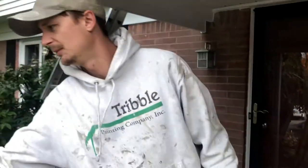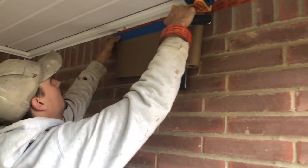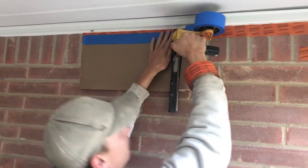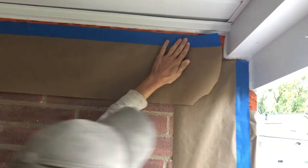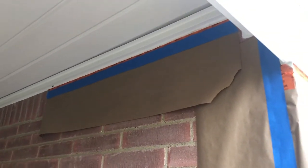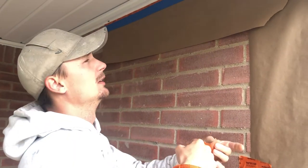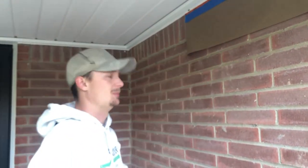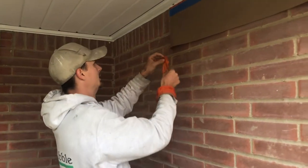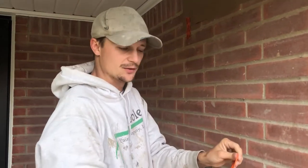The next thing you want to do is take your handy-dandy hand masker. You're going to pull it to length and stick it right on that orange tape — that orange tape is going to give you that great base. Just cut it to length, and you can fill in any other gaps with orange tape if necessary. The paper taper here is going to give you about a foot of coverage, so if you're doing smaller projects or covering up smaller things, it's perfect for it. Make sure you tack down the bottom side where you don't have any tape, because a gust of wind or even the sprayer will cause it to blow up and it could stick to surfaces you've already painted.